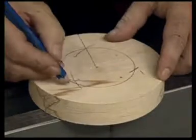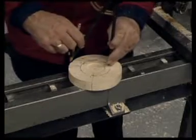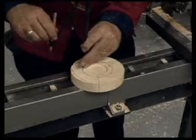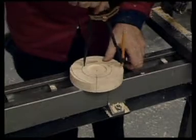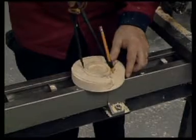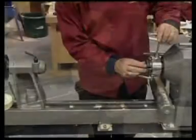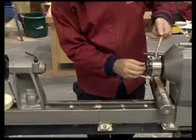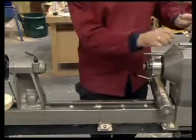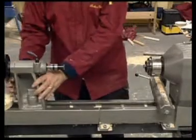Number the positions 1, 2 and 3. With a compass, mark the limit of the three sides to be turned. On this bowl, you will note that the sides do not meet, thus giving 3 long and 3 short sides. At the headstock end, fit the Steb drive into your Supernova chuck. You could of course use a standard Steb centre on a Morse taper and place the revolving Steb centre in the tailstock.